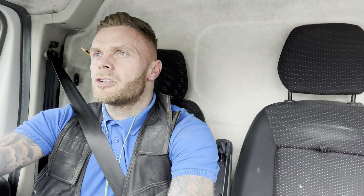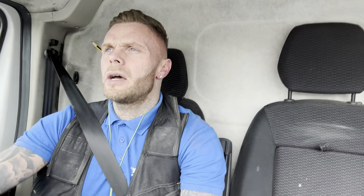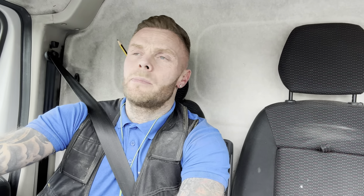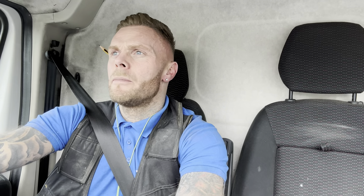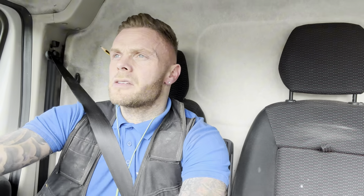We bought all of our equipment from Sprayman UK - our last two setups. They're just so helpful. Initially, probably about six years ago, we weren't spraying at all, and when we went through to them we got a lot of advice on different machines. We ended up going for an air-assisted airless setup - we've got the Graco GXFF connected up to an airline. We've got the model up from that as our backup machine, which is bigger, but because we've got so many tips set up for this machine with the airline, we get a nice finish. For cabinetry and fitted furniture, what we're doing works perfect.